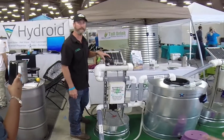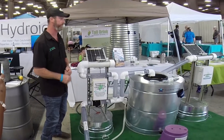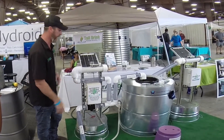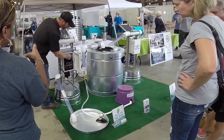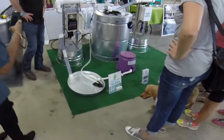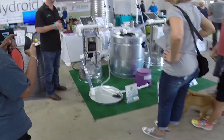And that's pre-filtration at its best, because there is zero maintenance that you have to perform on repeat. There's no going back and opening valves to let the water out like with a chambered first flush system — you have to empty those out manually. With this system you don't — it does it automatically. After that 12-hour clock runs out and there's been no rain activity, it's going to automatically flush your conveyance drains, so you have zero standing water in your conveyance between rain events. Otherwise you're going to have stinky, smelly water.